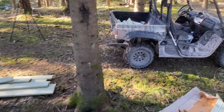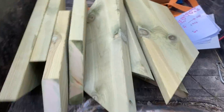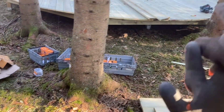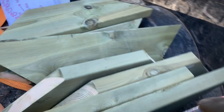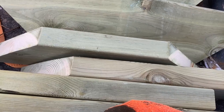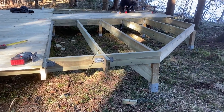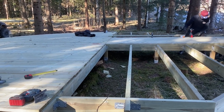I've just been up cutting some 45-degree stabilizers. We'll have to do this for all of them, certainly when the legs are up in the air on one side, just to make sure this weight is all stabilized. I'll chuck these in between the legs and the platform to stabilize them. Added some diagonals now — it's not so easy to do on that corner but I've added them wherever I can, and that's stiffened up the platform tremendously.